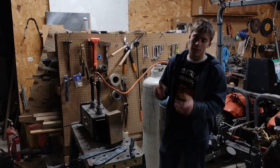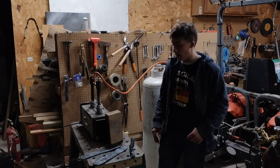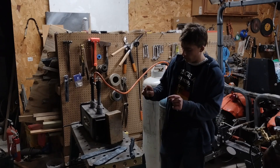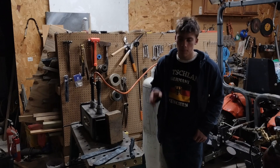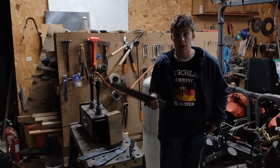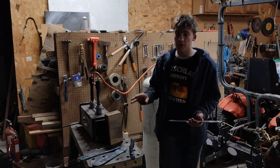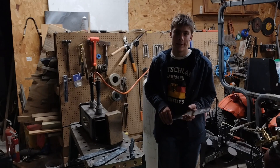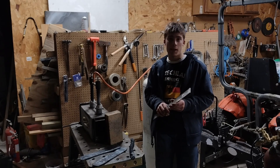And voila! If you haven't noticed, the video quality has dropped significantly because it's dark outside. So, I have forged the two stainless steel Sanmais, I've got the bar of twist Damascus steel fully twisted — that just needs to be forged down into a bar before I can make the knives out of it. And here's the AEBL I'll be using for some of the other kitchen knives. I've got all the steel I need here, assuming the stainless steel Sanmai has welded well, which is quite an assumption. Well, that's day one!